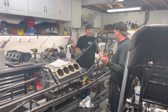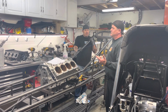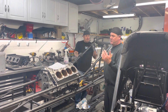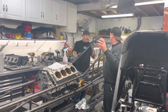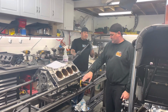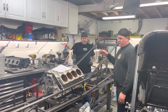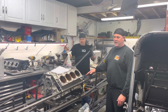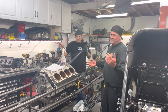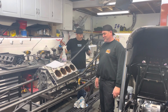And Rob said the 3/16 plate, the SFI spec is single 1/4 inch or 3/8 or double wall 3/16, and pretty much everyone does that because it sandwiches the rear end uprights. And all the specs from the SFI are from the motor plate back, and every chassis gets inspected before it races. And so once this car's done, we'll have it inspected, and then, you know, millions of dollars later, we bolt everything on, and we'll just cut her loose.